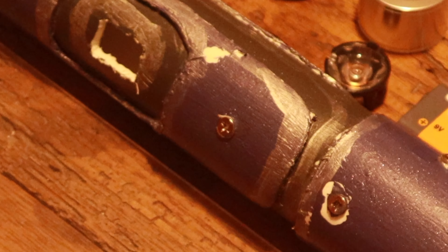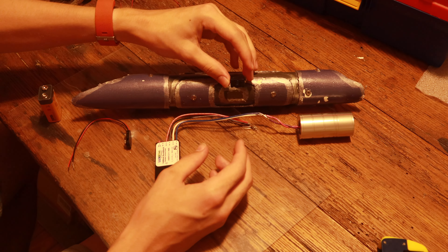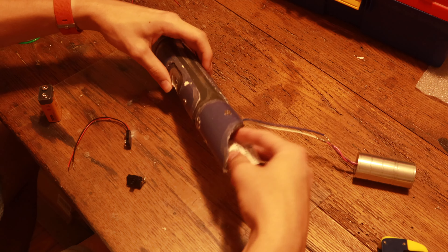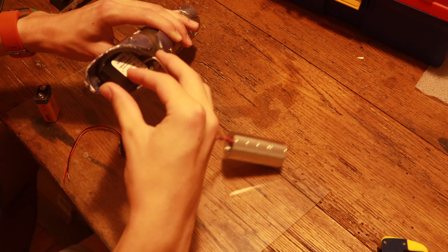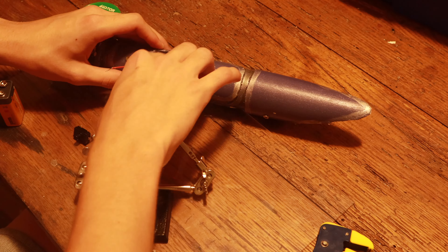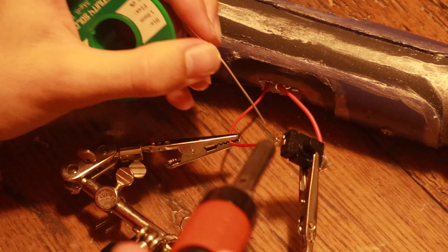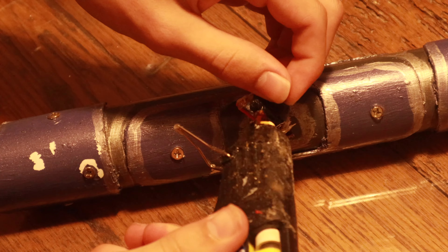This is the hilt I'll be using — just a piece of 1-1/4-inch PVC with some plastic cutouts that make it look more like a lightsaber. We're going to slide this switch into the hilt from the outside, so we need to put our electronics in the top of the hilt and push the power and ground wires through the hole. We can also slide the 9-volt battery clip through the hole and into the bottom of the lightsaber. I'll solder the ground wires together, put them back in the hilt, and then solder the power wires to each side of the latching button. Then we can add some glue around the latching button and jam it into the hole.